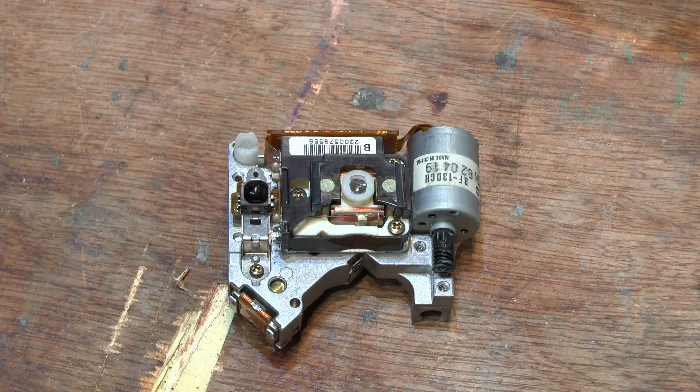It reads a CAV disc — kind of. I got it to read sort of after the start rolled on a bit, in the middle. It would never read the CLV disc — the extended play discs — never read them. Obviously the laser was just about right to read the bigger tracks on the other disc. It would read CAVs to some degree where you'd get a picture, you'd get sound, but a bit garbled at the beginning and a bit garbled at the end.